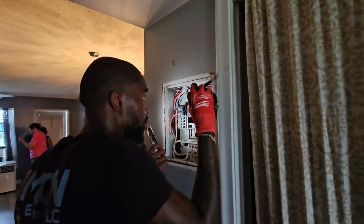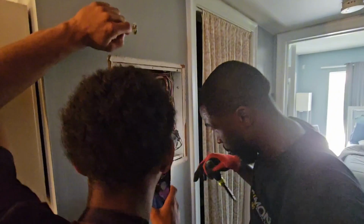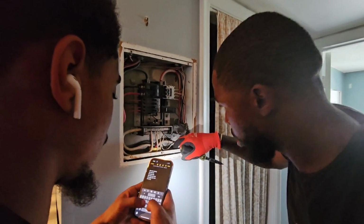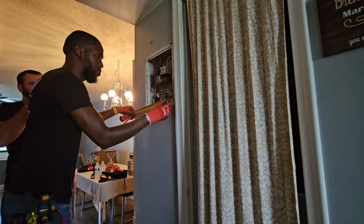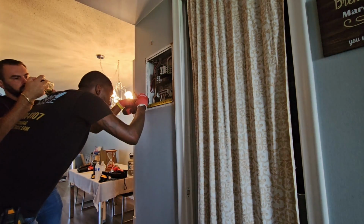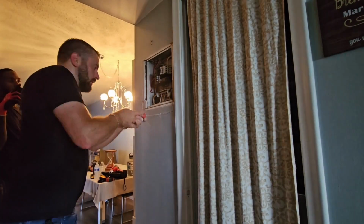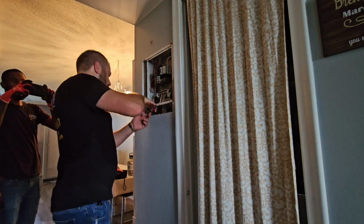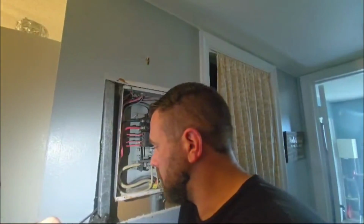So you want me to do five half-inch, 1 3/4, five half-inch, 1 3/4, five half-inch offset. So what I'm doing right here is we carefully measured the wall and looked at the specs on the panel we're getting from the supply house to make sure it fits perfect with no drywall repair. That becomes a little frustrating later. We also need to notch the metal stud and bend part of it out of the way so that the standard 14.5 inch wide panel can fit there.